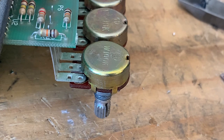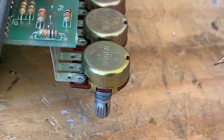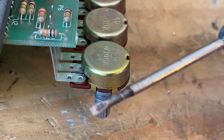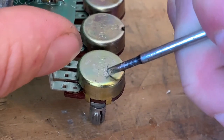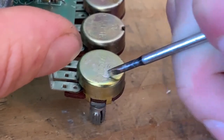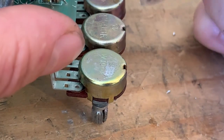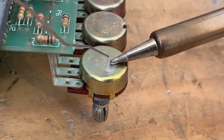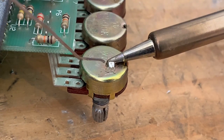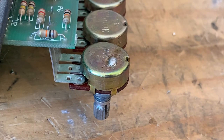Another request was about soldering to pots for ground connections. In this pedal application it's not required, but if you're building an amp and you need to ground a component on the pot, this is the way to do it. Take a small flathead or an exacto knife and scrape the back of the pot in a crisscross pattern. This gives something for the solder to stick to, because if you try to solder onto the smooth back of the pot, it's not going to stick very well. Heat up the pot where you scraped it and start applying the solder, then let it cool.